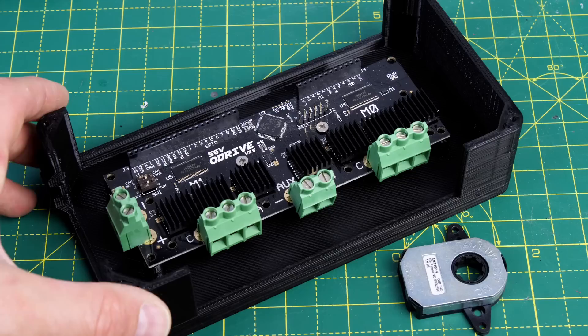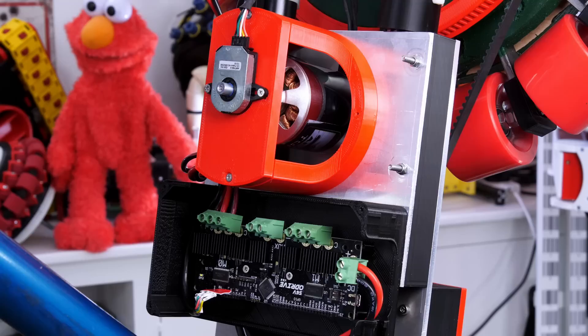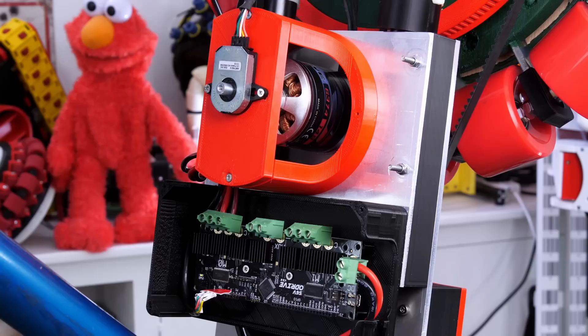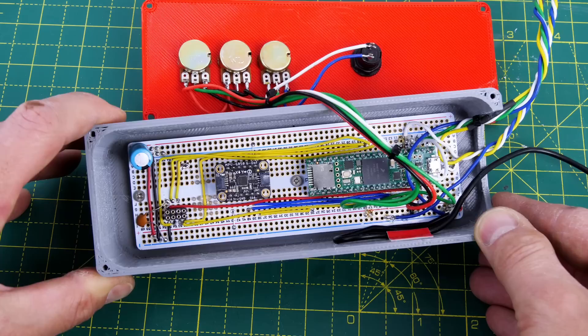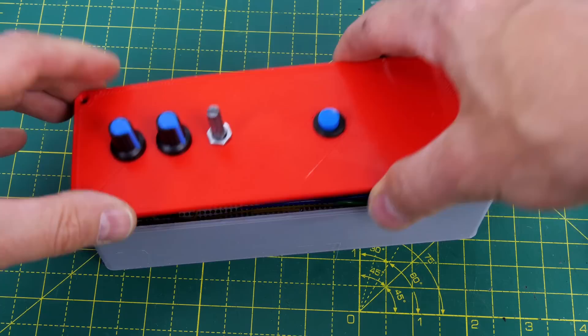There's a plate on the back of the motor with a bearing to hold the back of the motor and that's also going to be where the encoder mounts. I'm using an oDrive 3.6 56-volt version which is going to control that brushless motor with the encoder, so basically I can tell it what velocity to run the wheel at and it sorts itself out. It's powered from a 6s LiPo which is going to be about 24 or 25 volts and that's mounted on the bottom of the crossbar. I've also got some clever electronics made of a Teensy 4.1 and an MPU6050 inertial measurement unit that's going to measure the angle, with some pots and buttons broken out to the top.